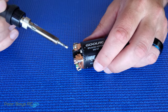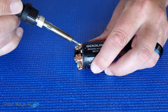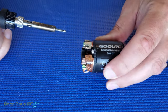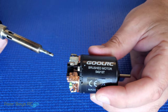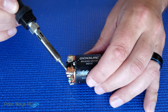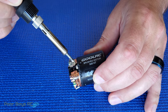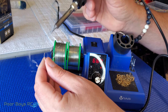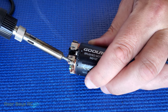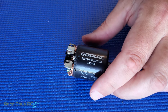It's been a couple minutes and our soldering iron is nice and hot now. You can see it flowing out nicely and really penetrating that tab. Heat is the key. For this big thick tab, we needed to have a little more heat. Now that it's cooled down, you can see I can get my iron right back on there — it's hot enough that it can melt it really quickly. Look how it just flows out so nicely. We've now beautifully tinned and prepped those tabs for the motor leads.